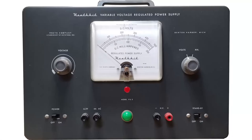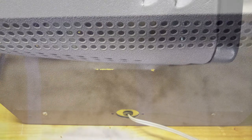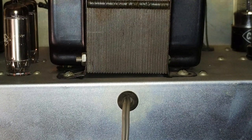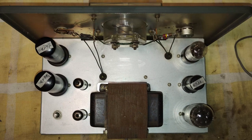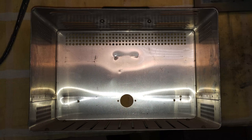This item came with a red dot centered on the front panel that does not appear on other units visible online. The meaning of this mark is unknown. This item was shipped and arrived with a bumped cabinet, some tubes out of their sockets, and a power transformer that was trying to leave the chassis. This points out that the chassis is very thin compared to the mass of the transformer, which in the presence of vibrations would make the chassis oscillate. Apart from a bad shipment experience, the front panel and the rest of the cabinet are made of aluminum, making them fragile but not affected by rust.